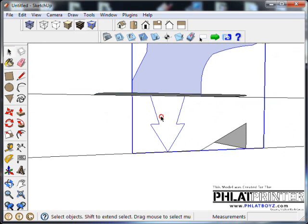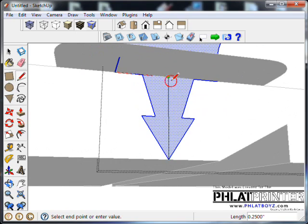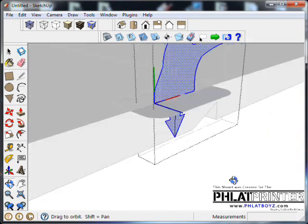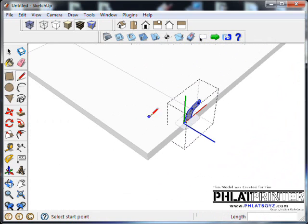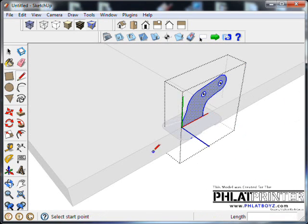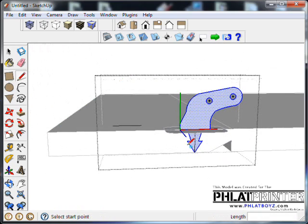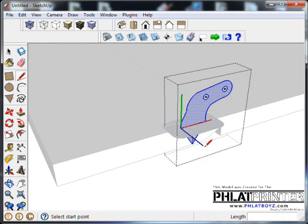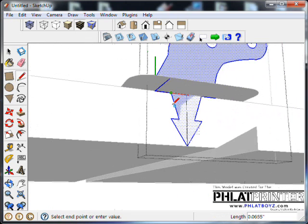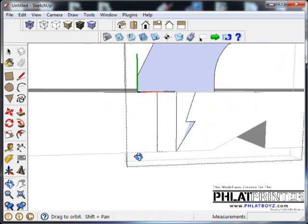So what I think I'm going to do is double click on this. I'm going to change this up a little bit, because I'm thinking what we could do is when we use the flat printer to actually make our elevators or rudders, and we know we're going to use something like this, we can take the drill bit and just cut a line like that, a 1/16 inch line, which would be perfect because it allows us to push this down in there. So it doesn't need to be spiked or anything. So I'm just going to go through, I'm going to bring this down, get rid of this arrow altogether, and it'll strengthen this whole thing a little bit.